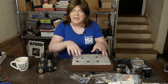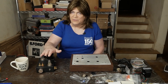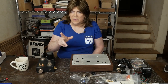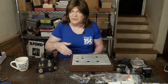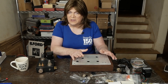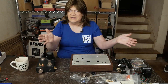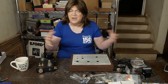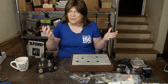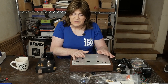The cool thing about the color preamp is it's very similar to the universal preamp, but it will only work with a 12AU7, which is fine, because most people don't need a lot of gain in a preamp. They're looking to put something like this between a DAC and a solid state or class D amp that maybe sounds too sterile, and they're looking to put some life into it or some color. Very cool design.